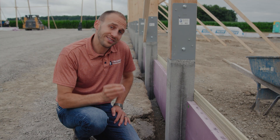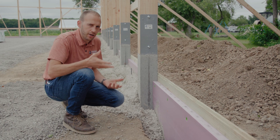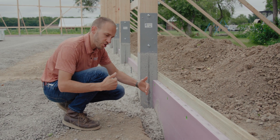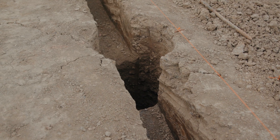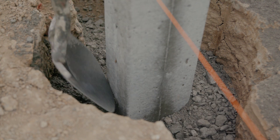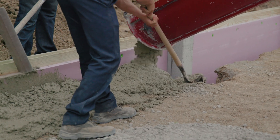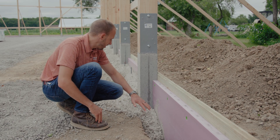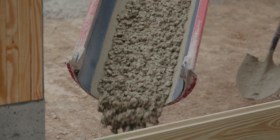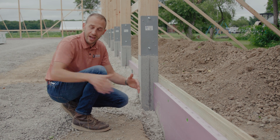It works really slick whenever you're trying to do an insulated grade beam that might be required per code in your state. I want to get you a good close-up picture of how this looks once the concrete's poured and give you an idea of what an insulated grade beam actually is on the finished side. We have a 2-inch styrofoam that's 24 inches deep, set just outside the edge of the trench — a 10-inch trench that leaves about 8 inches of concrete fill. The holes are drilled 4 feet down, and you simply backfill around the bottom 2 feet to bring it up to the bottom level of your trench. Then you pour your concrete straight through the trench, on top of your post holes, up to your finished floor mark. You can see here this concrete was poured yesterday — it fills the trench, comes around where you had your hole for your column, fills that space as well as your backfill. Then you see the rebar sticking up, which adds a nice connection between your grade beam — kind of like a mini footer — and your slab to help hold things together.